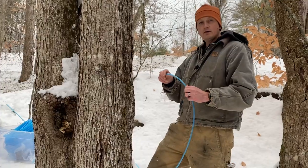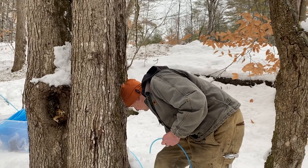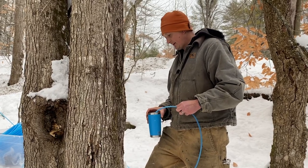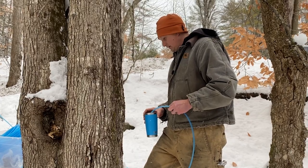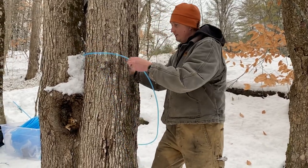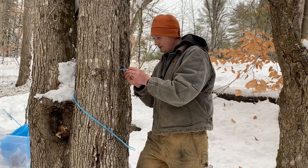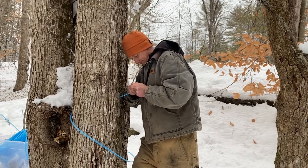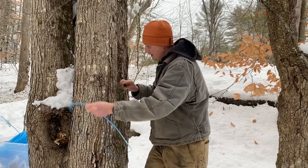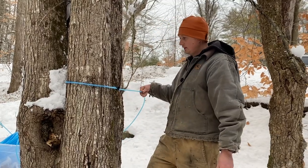Here at our first tree, I've got my lateral line ready to start. I've got a cup of hot water to make it just a little bit softer — I'm going to dip that in there for just a couple of seconds, just enough to make it a little more supple. I've got my end-of-line coupling right there, and I'm just going to press it on all the way. Then pull it tight around the tree, and voila — you have started your lateral line.